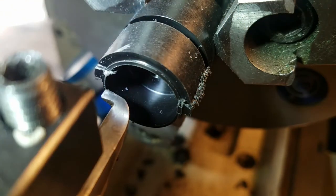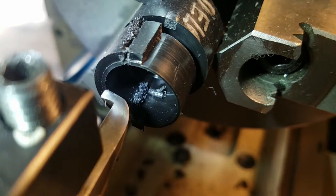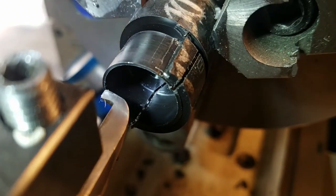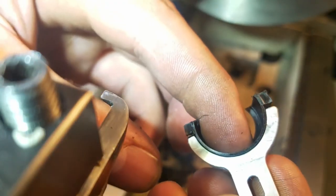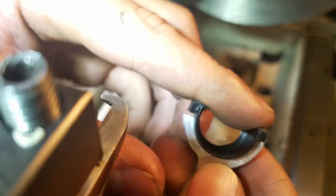I cut a small groove with my hacksaw through this so they're disconnected now. There's the piece I want — I left a lot of room so I can hand-file it. I parted off through here but I didn't quite get the bore deep enough, so the part-off hadn't actually separated it. I took the boring bar and just bored a little deeper until they came off — just like that. There's the part, and it just fits right in there. There's a little bit of side wiggle but I'm okay with that, and it's a bit wide which I can file down. I'm really happy with it.